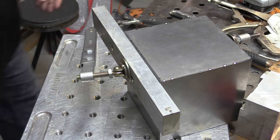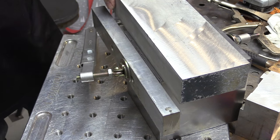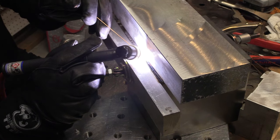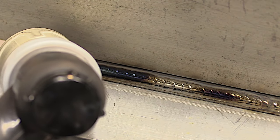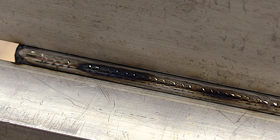I mentioned earlier about using chill bars for welding thinner steels like 18 gauge. This is 18 gauge cold rolled — I've got one big aluminum block clamped and just laid the other one on top to create a kind of argon trough that traps the argon and pulls some heat out. It's doing a really good job. Carbon steel welds tend to come out dull and gray without chill blocks, especially on 18 gauge. This makes a lot of difference — again, you can't always do it, but when you can it's worth the trouble.